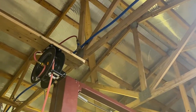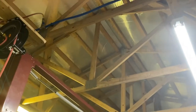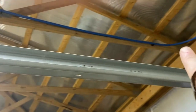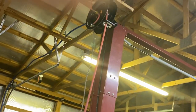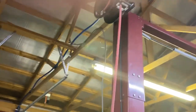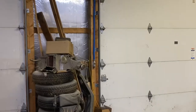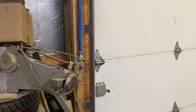I'm going to put another T right up there and run that line down the post of the lift, then put another drain right here just so I can drain that run. Also, that T fitting is pretty high, so a lot of moisture that you do get in this long line will go back down the hill and eventually find its way to a drain. Then we continue on down to another outlet and a drain — I never get any water there.